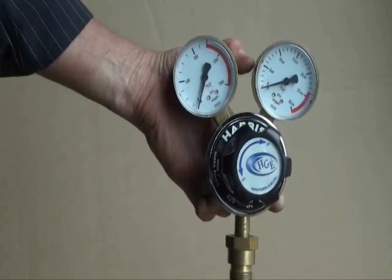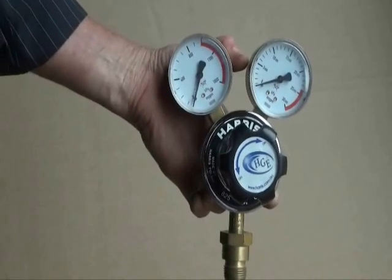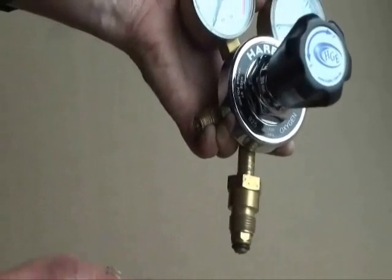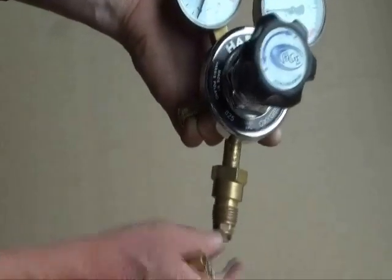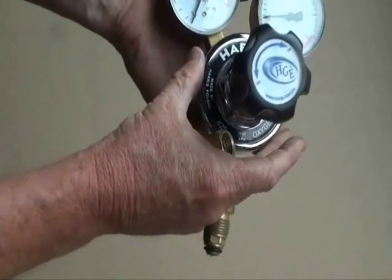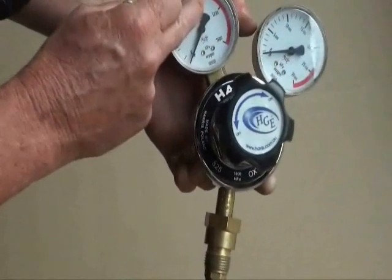The 825 Oxy regulator is in both the Professional Oxy LPG kit and the Premium Professional Oxy LPG kit. It incorporates various safety features — it has a SnapSafe stem, so if an unrestrained cylinder falls over, the gas flow is shut down. It's a big-bodied regulator so it gives great dynamics: high flow, up to 1000 kPa.